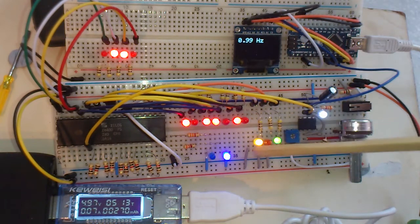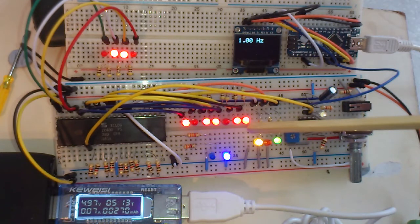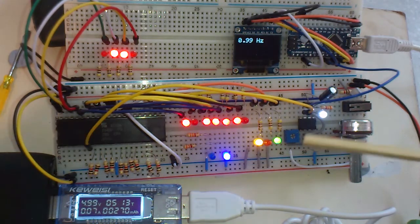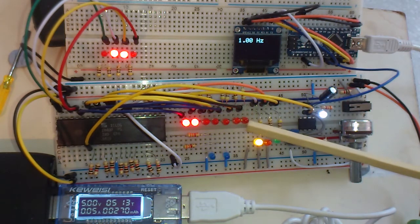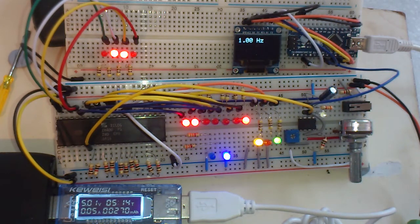And as you can see, when the M1 pin goes high, the address bus increments, and then just shortly afterwards, it's only about half a clock cycle afterwards, the read pin and the memory request pin go high, so that it then reads the opcode. The reason it waits a little bit apparently is because Z80 wants to make sure the address has settled, is stable in the memory, so it just waits a little bit. It's not a full clock cycle, it's just half, and you can see it very nicely at this speed.